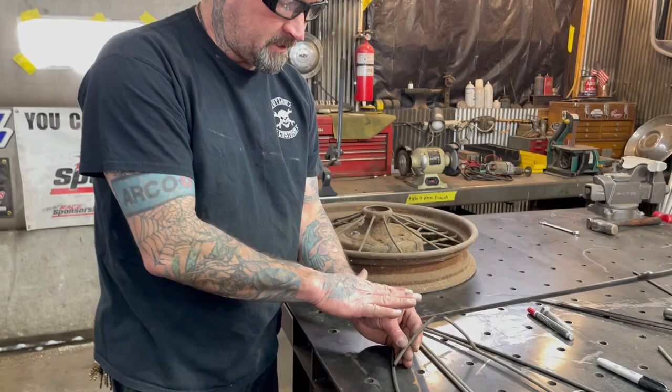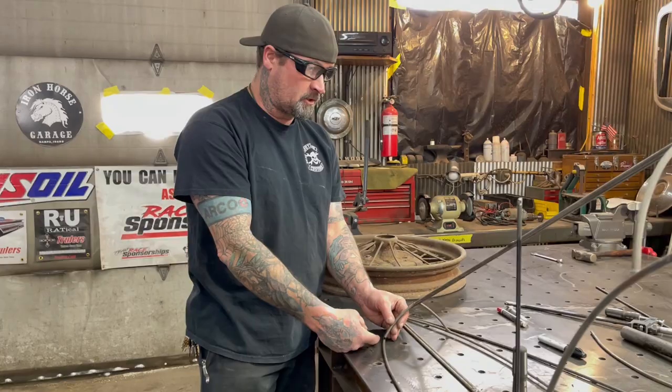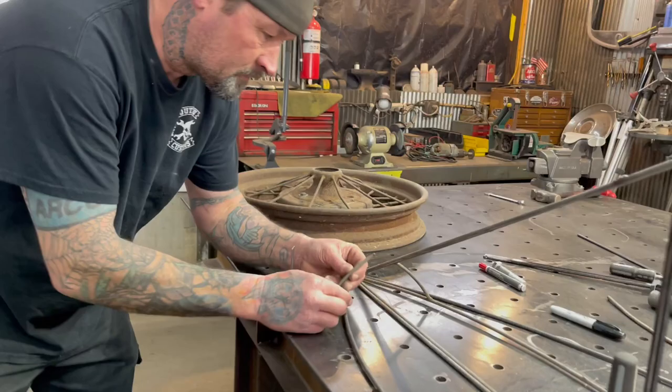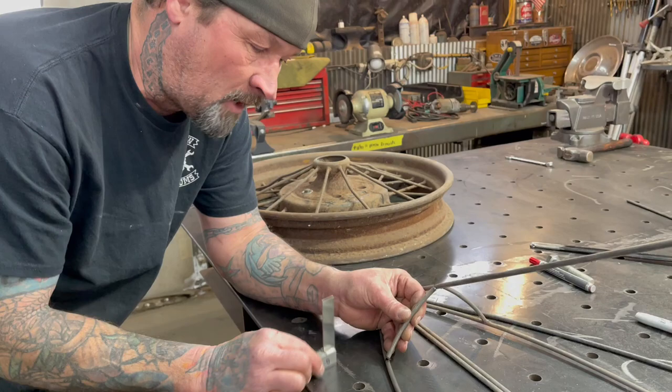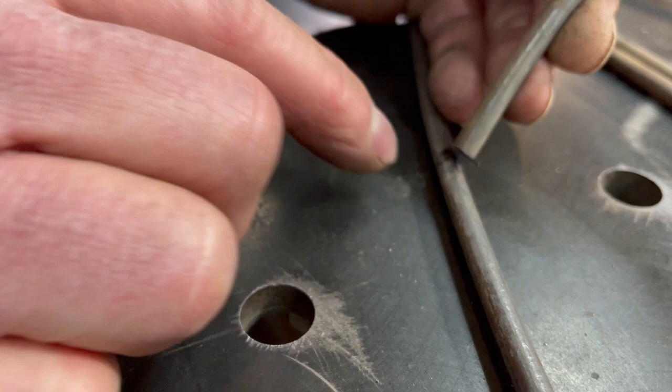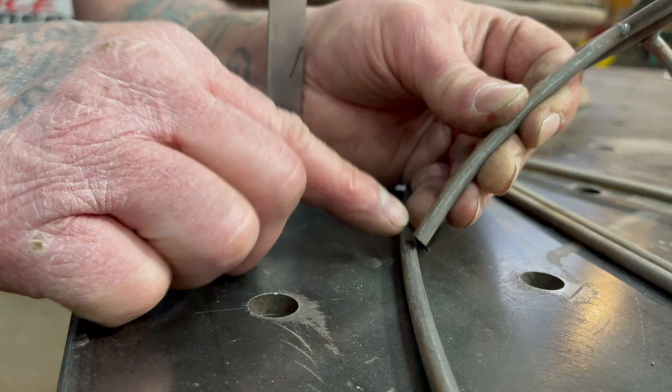One of the things when you're doing wire form bucks — since the metal is going to be sitting on top of this — let me grab a little square real quick. You want to make sure that when you put these pieces of wire or quarter inch round rod in there, you could tip something towards it and have nothing sticking out. Right there is too much — I want to push that in a little bit so it's a nice flush fit because the weld is going to stick out a little bit. When everything's welded solid, I'll grind that off so when I'm shaping my metal it'll sit flush on top of there.